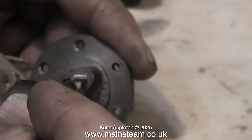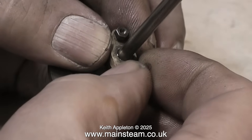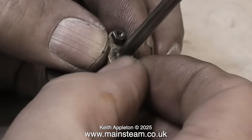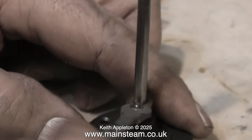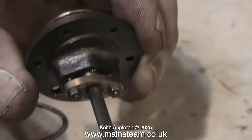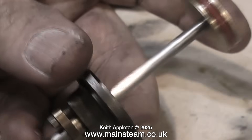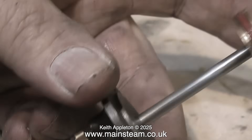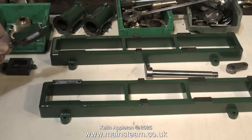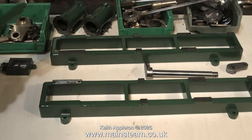There's something deeply satisfying about doing this — particularly when you put the nuts back on without dropping them on the floor. When you tighten the glands, don't go mad. You need to nip up the gland and then back it off a little bit; that way you get a nice sliding motion without any pressure leaks. If you over-tighten the gland you will actually score the piston rod.